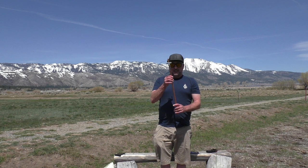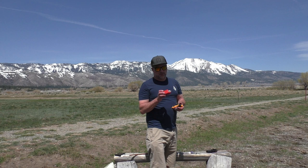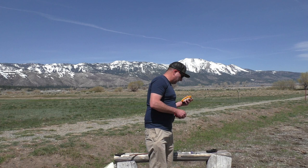I got this ground stake I'm going to hook up. I'm going to be doing — I think it's like 143 or 203-foot wire, I forget. It's been a while. And then I'm going to be doing my 9-to-1. I'm doing a random wire this time. This is some 26-gauge wire — a little bit lighter than the 24 I was trying last time. I'm hoping to get it out there a little higher.